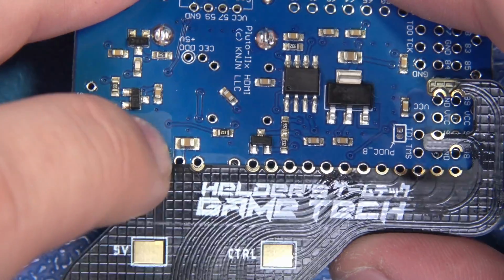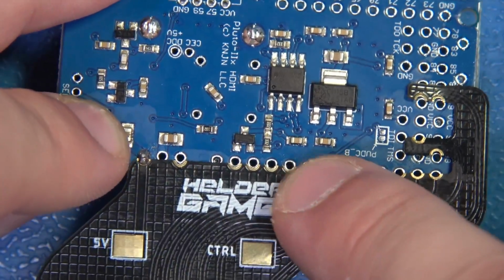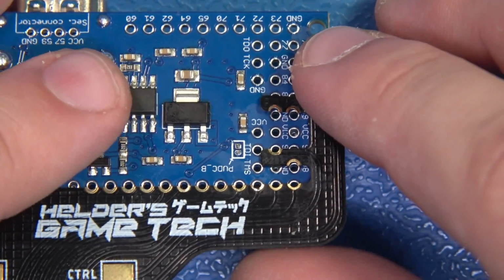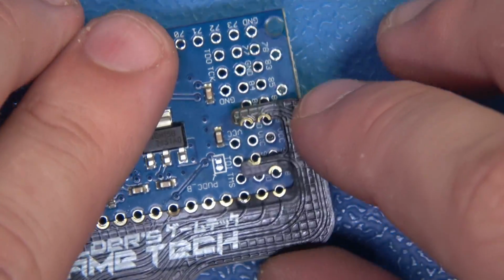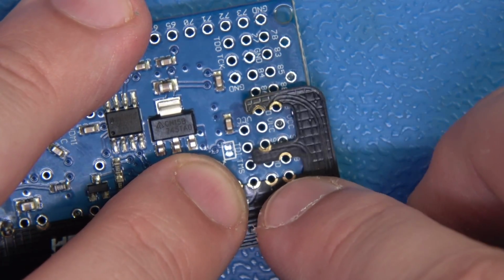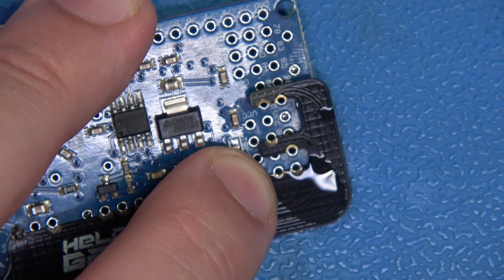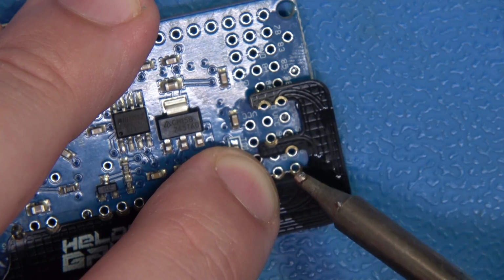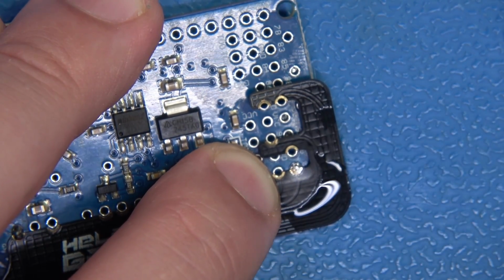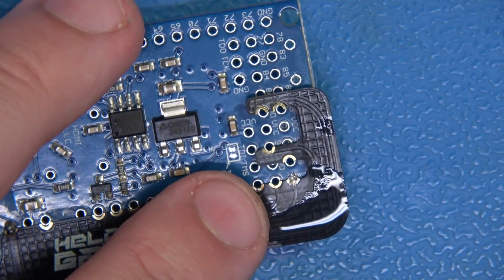Now once again, that's not a finished joint, that is not a complete joint, that's just a bodge to hold this in, but if you look, our alignment going down looks absolutely fantastic. Let's start right up here in this corner, and let's just make sure, yep, everything looks just fine. So I'm going to go ahead right here, I'm going to hold this down, just a drop once again of some good old-fashioned no clean, and I'm going to come right into this corner and just do another contact. 1, 2, 3, just like that. Boom. Perfect. Again, that's not a finished joint, we're just holding things in.